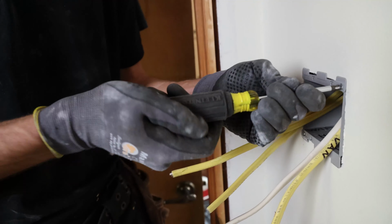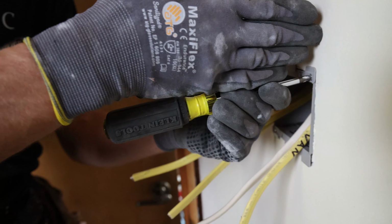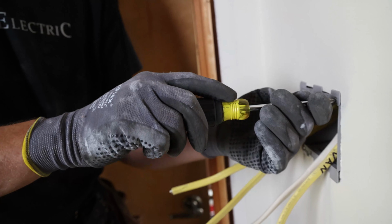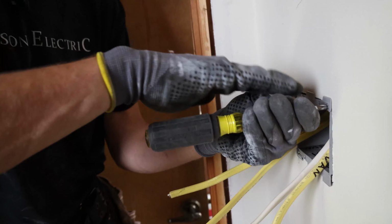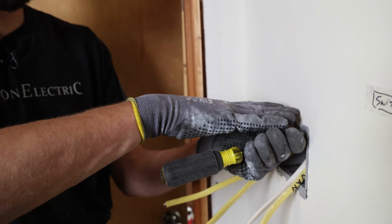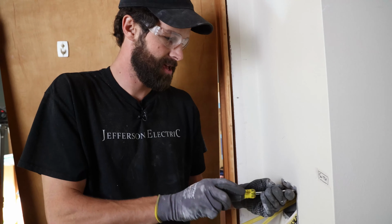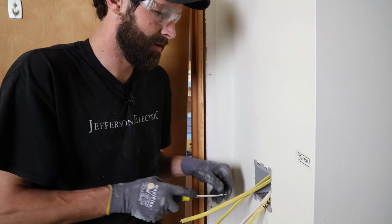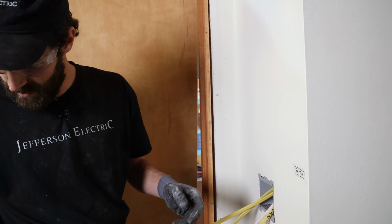It's there. Make sure it's level. You can feel those tabs. You need a quarter turn for the tab to open up and grab drywall. You can feel it move. There is insulation, so you have to watch out because that insulation, if it resists the tab from opening, prevents that. The tab stays flat and the box pops out of the wall sometime down the road. You get a call back from the homeowner. Ugh. Not death grip, it's just holding the drywall. Boom.